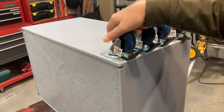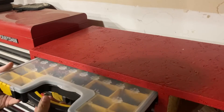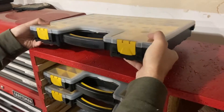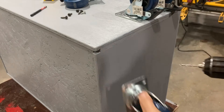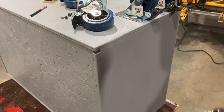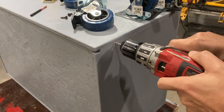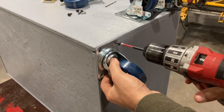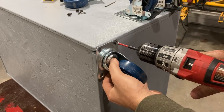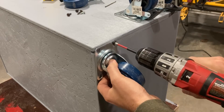To install the casters I will need some screws, and I can get those from my parts bin in my other rack. I am pre-drilling holes for the screws and using a mishmash of screws here because they can't be any longer than the thickness of the plywood, yet the screws have to have a really big head because the mounting holes in the casters are unreasonably large.